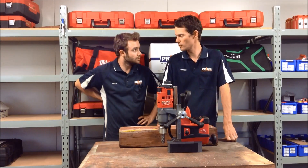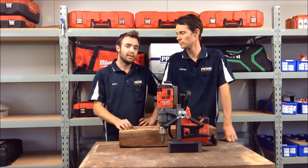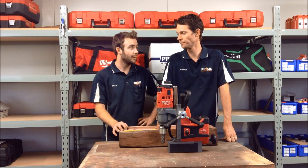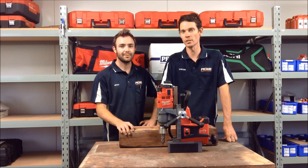Speaking of batteries — what kind of life are we looking at? With the 5Ah battery drilling with a 20mm broach through 6mm plate, you're going to get 40 holes. With the 9Ah battery you're going to get 90 holes out of that same run time — extraordinary performance coming soon. The 40 holes out of the unit at the moment is groundbreaking for cordless technology. If you have any feedback on the unit please leave it in the comments below, give us a like and a subscribe if you're interested in our videos, and let us know what you'd like to see in upcoming videos. We'll see you next time — thanks for watching.